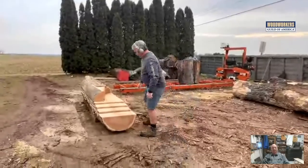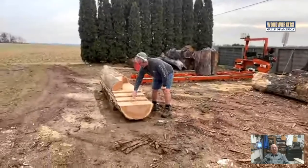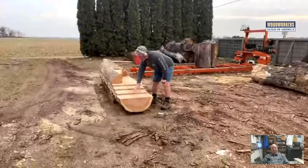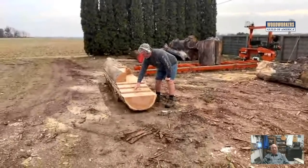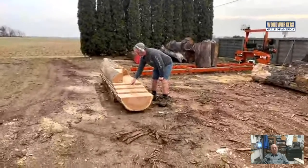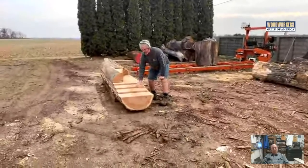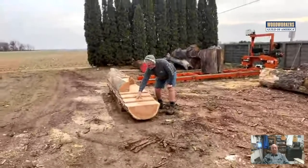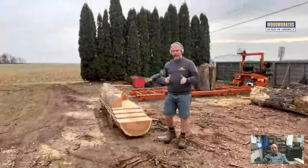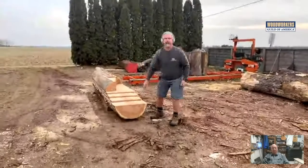In the center here, you can kind of see this dark brown. That's more of a decay. This log's been sitting at the customer's lot a little too long. But this is that pith. This is that troubled grain, tension grain area that we will eventually put on the edger and cut this section out and throw it into the firewood pile, and then save that perfect quarter sawn board. They'll end up being about 8-9 inches wide.